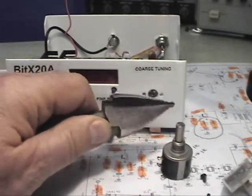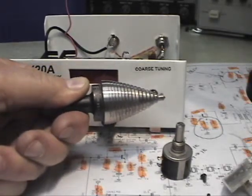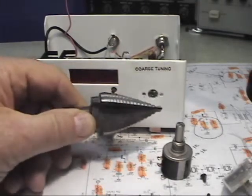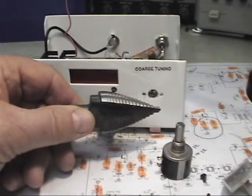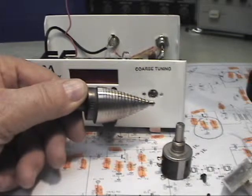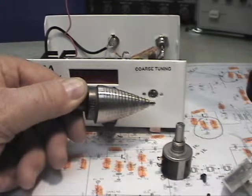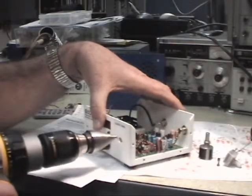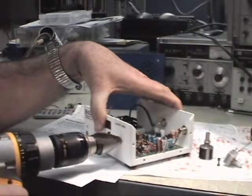One of the easiest ways to do a clean hole in sheet metal is using a step drill. If you don't have one, you can use a hand reamer, but a step drill will make a super nice round hole, and if you use a variable speed drill, they're very controllable. We just want to go up one step bigger than what is currently in place on the front panel. The key is just go slow and easy and you won't harm anything.